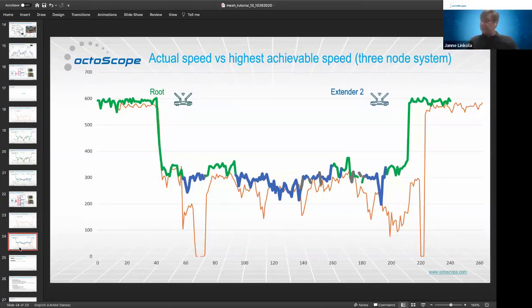All right. Clear enough. Let me address the first question first. So just to play back, you're asking, well, we saw AP steering here. Can we essentially test band steering? Well, from a BSS transition message point of view, it's the same exact message. It's a different BSSID. The steering AP just gives its own 2.4 gigahertz version of the BSSID. So from our point of view, it's the same exact test.